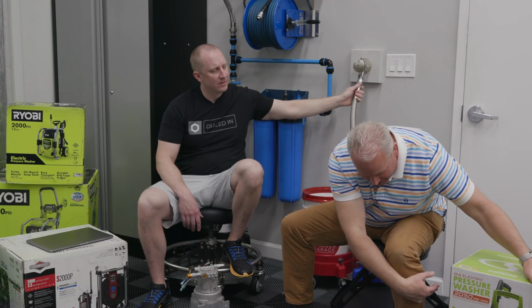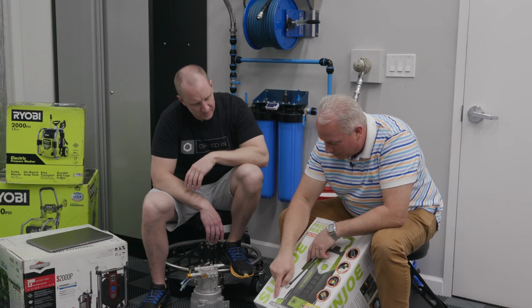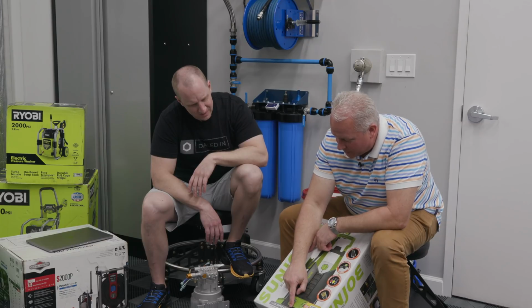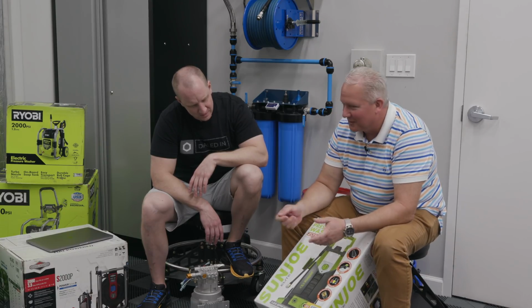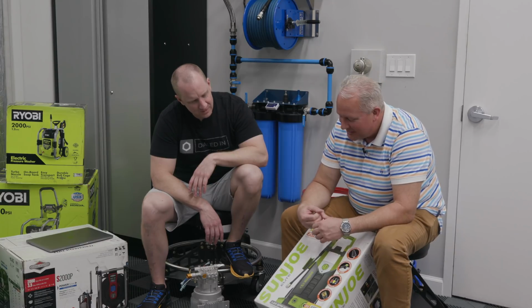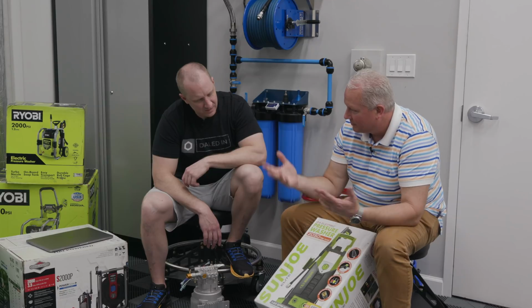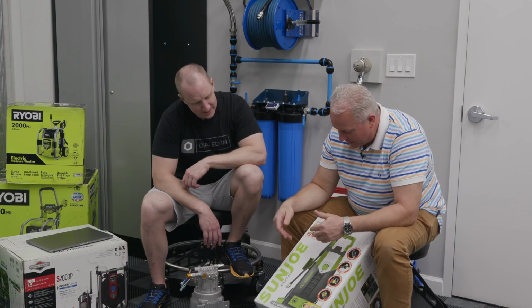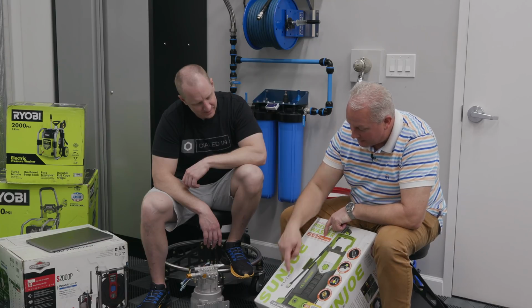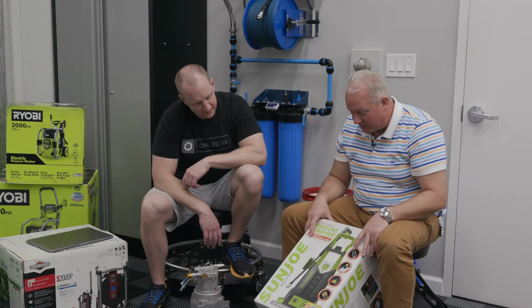It was funny that you brought that up, because that is the other number that they use here, 1.65 gallons per minute with the nozzle at open minimum pressure, right? So what that means is remove the nozzle and just let the water kind of ooze out the end of the wand. And their argument is that, hey, you can use it that way, right? You can take the nozzle out and use it almost as a garden hose, just letting the water come out the end of the wand. So that's what they're saying here. We talked about this earlier, how they're getting their PSI, and the 1.65 gallons per minute is with the nozzle removed, basically what they're telling you there.